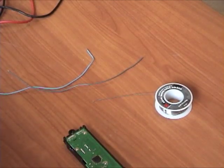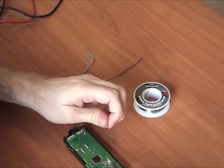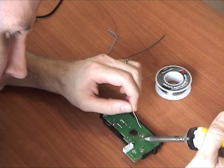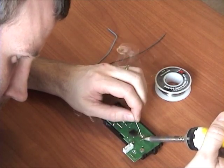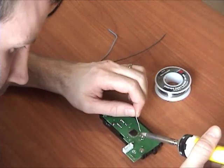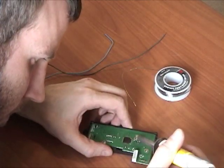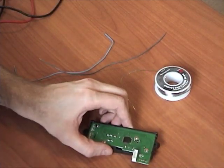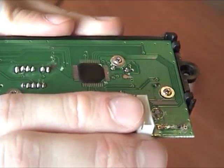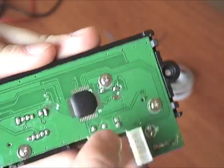Our soldering iron is heated up. What I'm going to do is just put a little solder on these pads first just to get them started — I'm going to put the soldering iron on the dot for a little second and then just feed a little solder in there. You can see there are now two little dots that kind of stick up compared to the other dot, matching those other ones. If this screw is in your way and you're scared of it, you can just remove it.